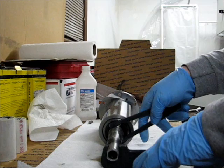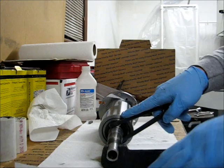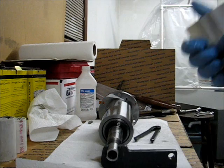So I tightened it to about 5 degrees. I've heard some people say they tightened it more. I really cranked down on it last time, thinking I needed to get up near 10 degrees to get an idea of how things would run. And there weren't any problems with the cut. The cut was fantastic. Never mind the fact that I need to trim, but there's absolutely no indication whatsoever of axial float on the shaft. It's totally locked in, which makes sense because it wasn't going anywhere. I had it just about as tight as you could get it.